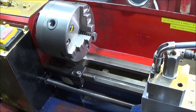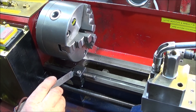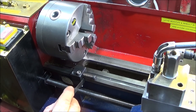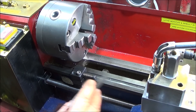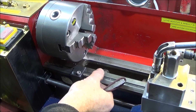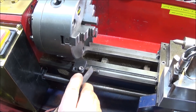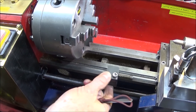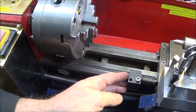When I bought my Chinese mini lathe several years ago, the first accessory I bought was this small carriage stop. I've been meaning to make a better one for some time, because the screw that goes onto the carriage is way too close to the ways and quite hard to adjust. The threaded part is really just a six millimeter allen bolt, and when it goes up against the carriage it's in a bad position — it's actually hitting the screw which holds the rubber ways cleaner on.